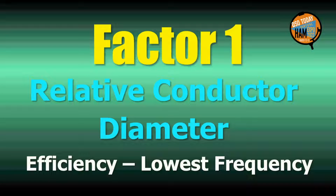Conductor diameter compared to loop diameter is the first and most important optimization factor. It's the biggie. It's where most loop builders fail. Conductor loss, or loop efficiency, is the number one concern with mag loops. It's not nearly as important a concern for larger, more familiar ham antennas like Yagis, full-size verticals, or inverted Vs.